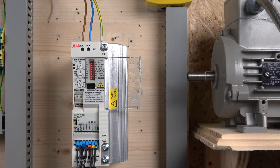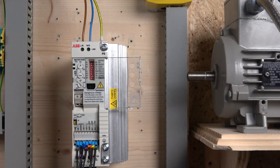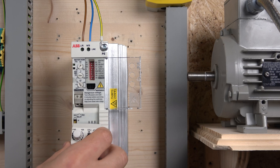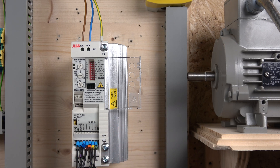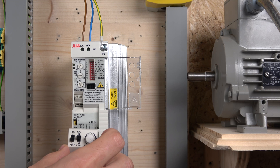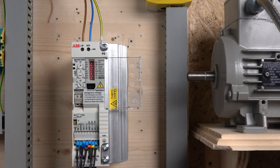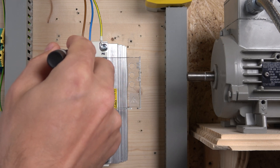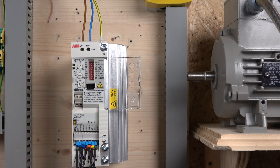As usual, let's go through the wiring. The drive is already wired into my control station. You can buy an optional plug-on pot that gives you run, forward, and reversing control — roughly 20-something pounds here in the UK. The motor output is at the bottom — T1, T2, T3 (or U, V, W) — and power comes in at the top as L for line, N for neutral, and PE for earth.